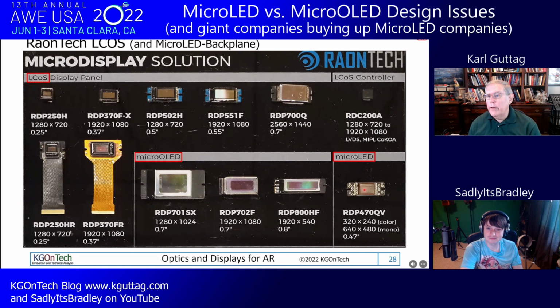And also, I think you'll see this even in OLEDs, like when you get your cell phones, how they dim. You'll see a lot of times they spec their brightness with 10% of pixels on or something, because if they put up a whole display of white, the light of a given pixel is going to be a lot dimmer. They have to dim. Well, you get that problem in spades when you're talking about things that can be as bright as MicroLEDs. I don't know what they're going to do if you put up a screen of white. I think it would melt.